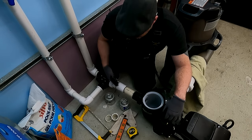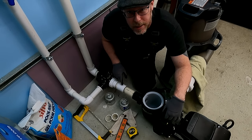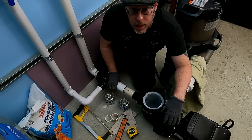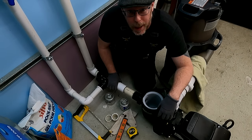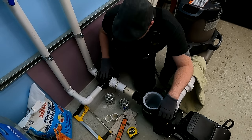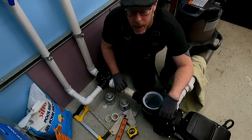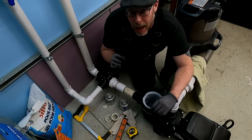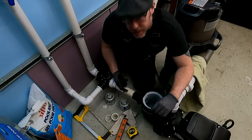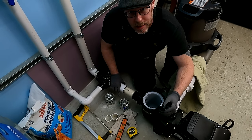This is two inch PVC pipe — we've got about 10 inches of straight run here. This coupling here is not ideal; I was running out of materials in my test lab, and the piece of two inch rigid pipe I dug up is about 20 years old out of the box — still good, it'll be fine. This coupling is not ideal, but I was very careful to make sure I had square cuts on the pipe and it didn't back off after gluing, so it provides minimum turbulence for water traveling into the intake.